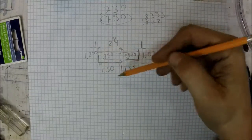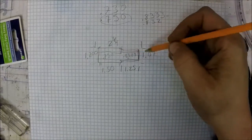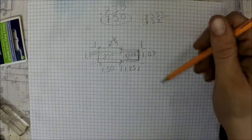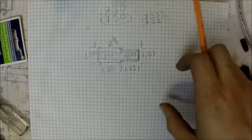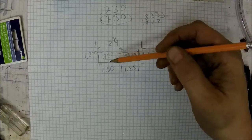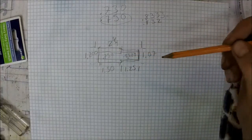I'm obviously by no means an engineer that knows how to draw up blueprints, but I can figure the design out in my head, throw it on paper, and then machine it. So this is what we're doing today. This bore will be taken up. Right now we just drilled it out to 750 thousandths, so it's probably just over that with the drill bit.